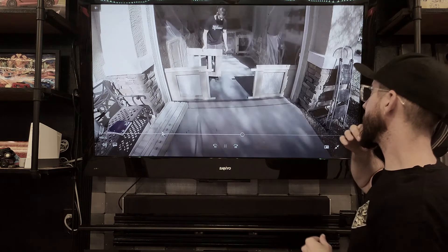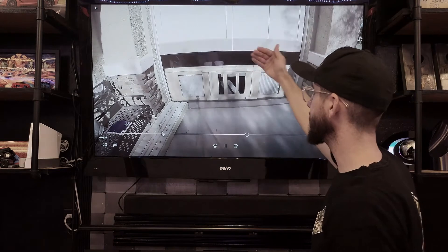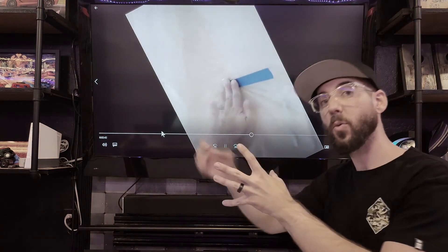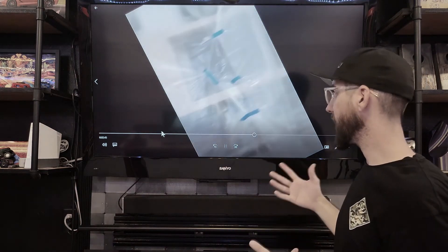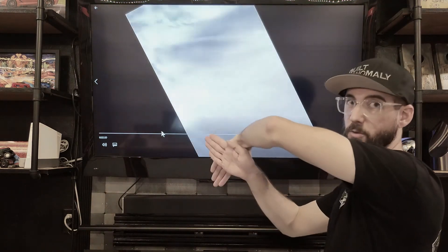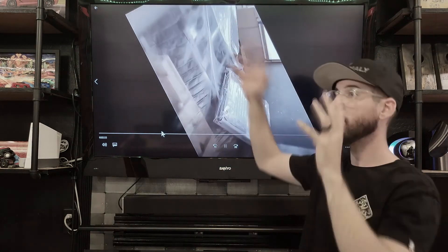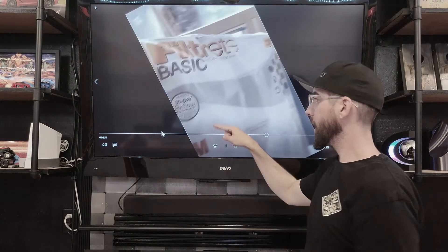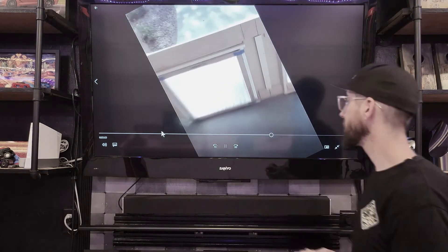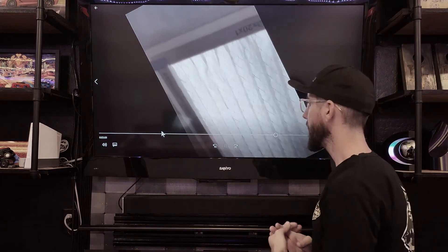This is a little device I built — the garage door sits on top, has removable filters, and ideally the fan comes from the front on the outside so you're pulling all the nastiness towards the filter and the fan stays clean. I had a filtration fan on the inside with filtration on both sides — dual layers. That grabbed about 80% of the airborne particles and brought them there, then it would settle on the floor and was easy to sweep up. That's the basics of the paint booth.